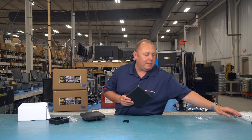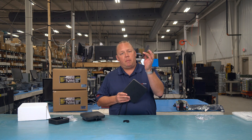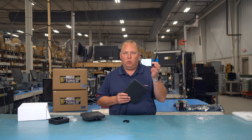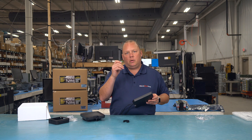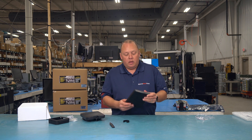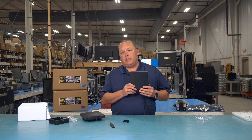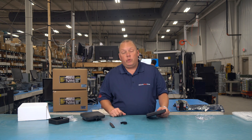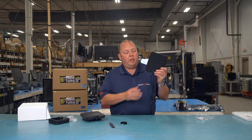In terms of performance: this is a PepLink PepWave antenna that comes with just about all of our popular mobile routers, and it's a two decibel gain antenna — meaning you'll do quite a bit better than a cell phone right out of the box. This Falcon antenna is a four decibel gain antenna. For every roughly two and a half dB of gain, you're looking at 100% more cell signal because of how cell signal is measured exponentially. So you're really looking at 100% signal improvement with a product like this.